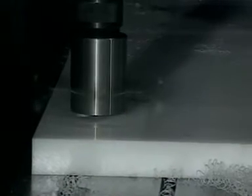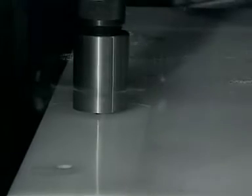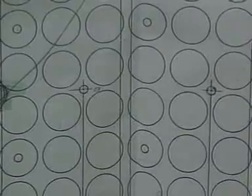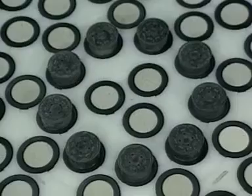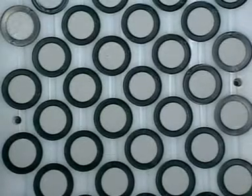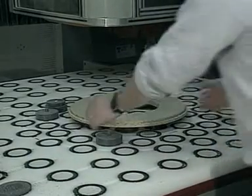Before the process of machining the pod cavities is undertaken, an appropriate pod panel layout and distribution must be designed. A typical uniform pattern might be spaced four inches or more apart on center from each other. The user can create any pod panel design in linear, circular, or diamond pattern that is most applicable to the parts being processed. In short, the pod panel layout should be designed to fit the task.